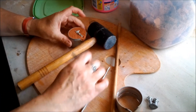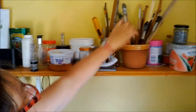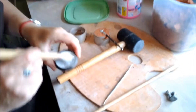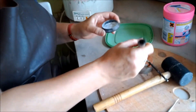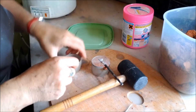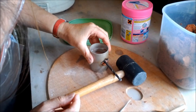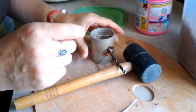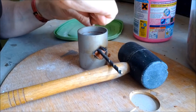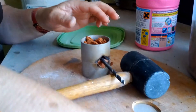Basically you're making a little bit of an indentation here. Now you have to create a release between the two moulds — not very high-tech, but talcum powder. Then you line up two lines of the mould so that you put it in exactly the same place each time. Sprinkle a bit of this in and pack it down a bit.